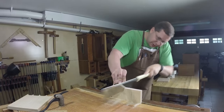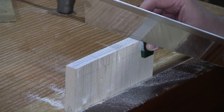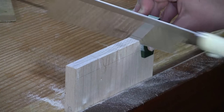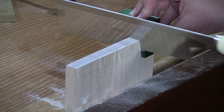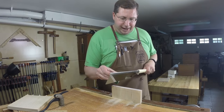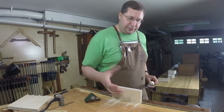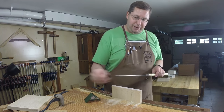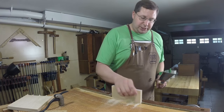It would help if I made complete saw strokes here instead of just dabbling at it — it goes a lot faster when you use the full length of the saw. You do have a lot of precision here because of the weight of these guides and the strength of that magnet; you can really dial in exactly where the kerf goes. It is interesting though that this saw almost isn't deep enough under the back. A lot of times I'm actually bottoming out. So there is some limitation with really thick boards. This is just three-quarter-inch-thick maple, but if I was a full inch or an inch and a quarter thick, this saw wouldn't be deep enough to make those cuts because of the added thickness of the guide.